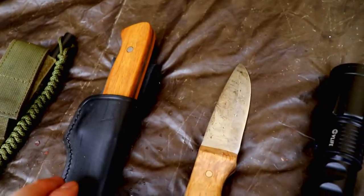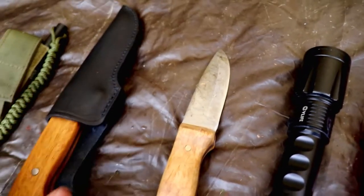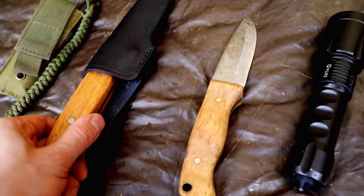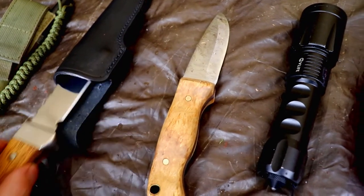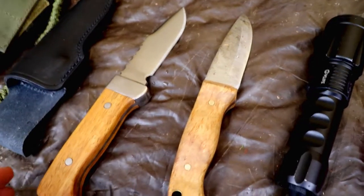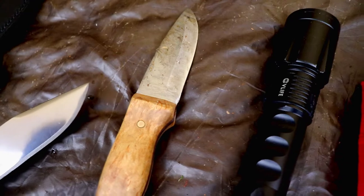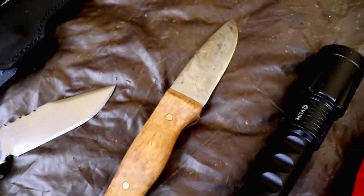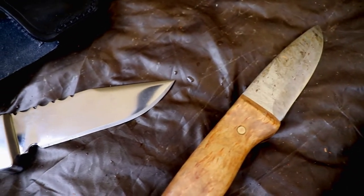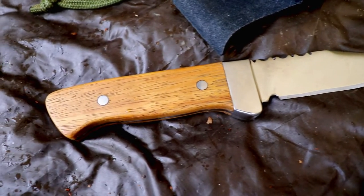And this one's quite different. It's not a typical bushcrafting knife. It's more like the American drop point hunters, I suppose. And again, I designed it myself. I sketched it out on some paper and then got my steel. These are stock removal knives. So I start off with a piece of 01 tooling steel and then sketch it out and then begin shaping and forming it.